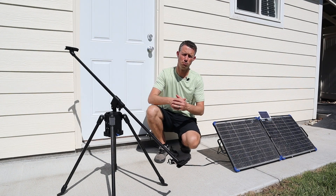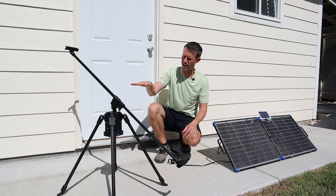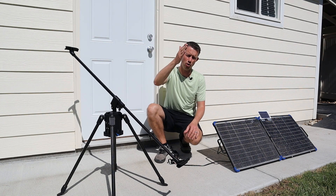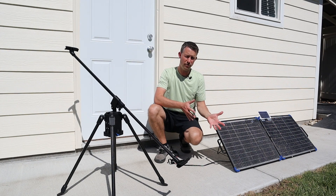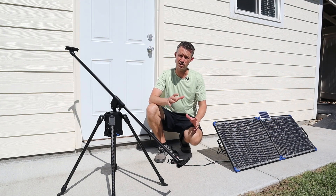According to UTOM from Solar Pivot Power, you'll get a bigger gain in the middle of summer when the tracker is angled flat towards a sun that's more vertical in the sky — I'm seeing less advantage as the sun is lower later in the year. So anywhere from 25 to 40% is a pretty big gain with a solar tracker versus just having the solar panel facing south.